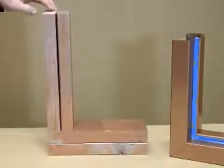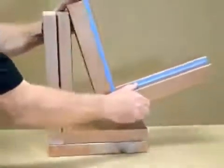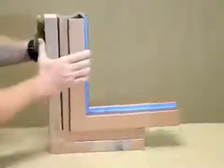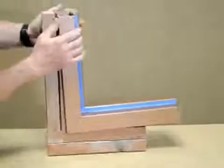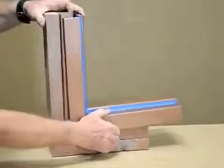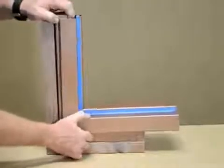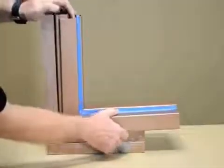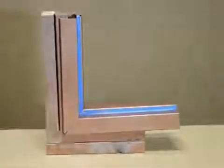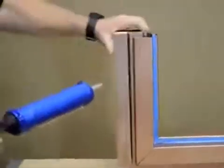The frame slips on and is anchored to the substrate. Make sure the frame is squared, plumb, and secured using the provided anchors as specified in the installation instructions. It is critical that the contact between the surface of the frame and the mounting surface maintain contact via a conductive caulk that will be provided by ASSA ABLOY. Once the frame is installed, the conductive caulk is applied to the joint between the frame and the mating surface.